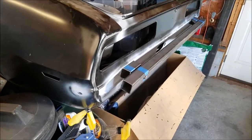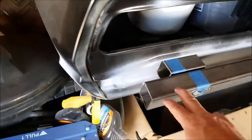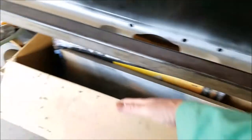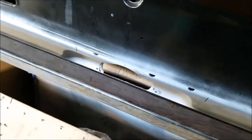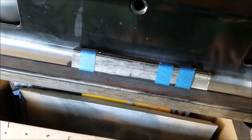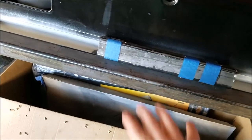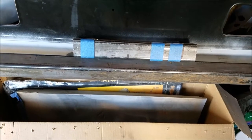Here's another update. I'm mocking it up right now and taking measurements. When I say 2x2 stock, I mean metal tube stock — it's an eighth of an inch thick. It's going to go all the way across, and the engine stand is going to be welded right here. This piece will sit between the car and the longer piece of 2x2 tube stock. I just need to use this as a measurement to spot the holes, drill through, and get the bolts going.